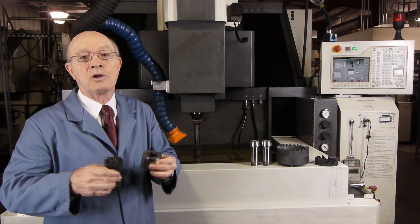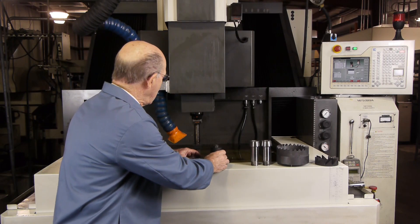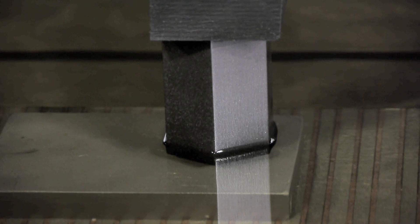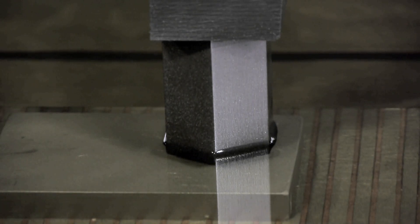In the machine, we have a hex electrode surrounded by oil. The oil is a dielectric fluid and acts as a resistor — it does not conduct electricity. When the sparks leave from the electrode to the workpiece, the sparks will jump and erode material from the workpiece, with just a little bit eroded from the electrode depending on the settings. You'll see the oil start becoming black.